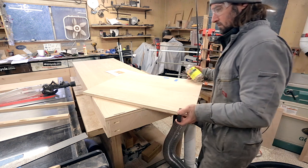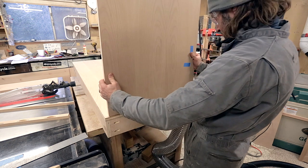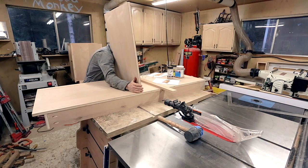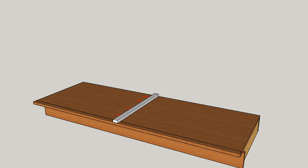As usual, I'll go ahead and test the joint to make sure everything lines up properly, and if it doesn't I will just cut them again — it makes the joint a little bit looser but they tend to swell up and it doesn't seem to cause a problem. The middle pieces are more difficult since there isn't an edge hanging over to line the thickness plate up with. I measure and mark out where I want my vertical piece to be located, hold it in place, and mark out where the biscuit joints should be. I then clamp a scrap piece at the marked location, which the vertical piece will back up against.